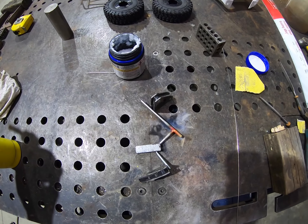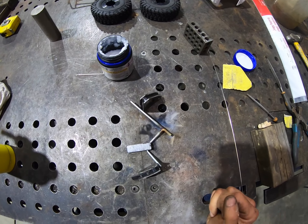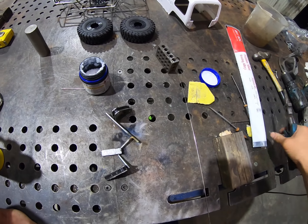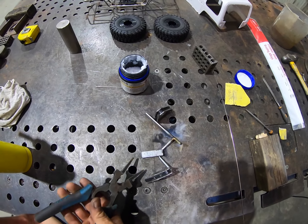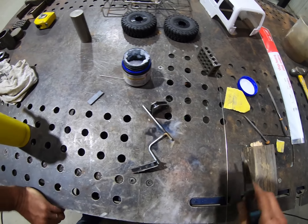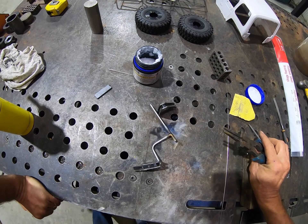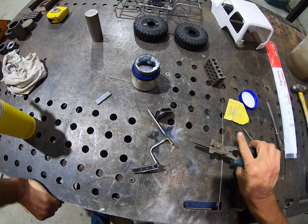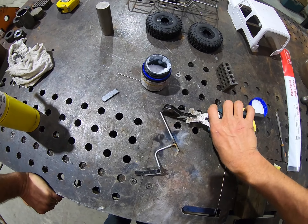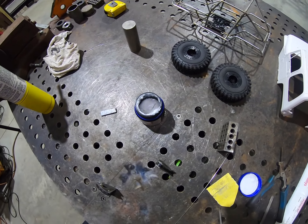It happened really quickly - and that's why you need to be in a good position and be relaxed, which sounds quite weird when you're brazing or welding. I do a lot of TIG welding and I find that breathing is really important. Let that cool down for half a minute or so, otherwise it'll just break apart really easily if it's still too hot. I reckon that should be fine now.